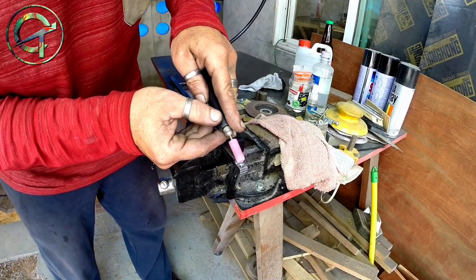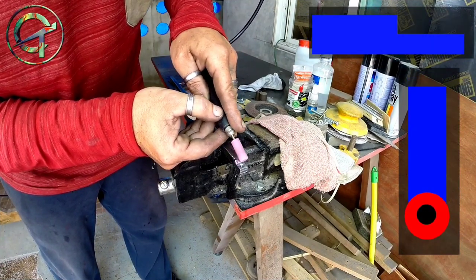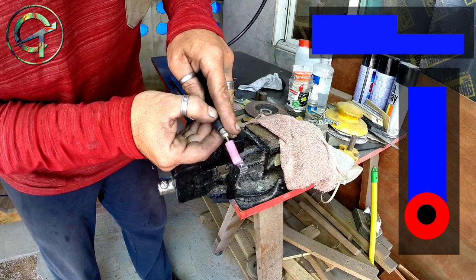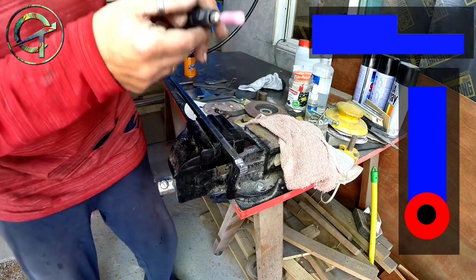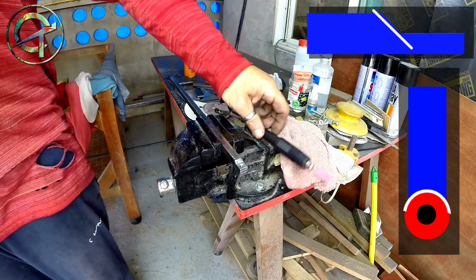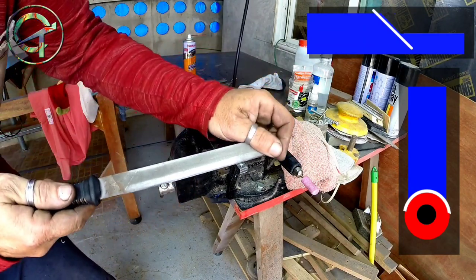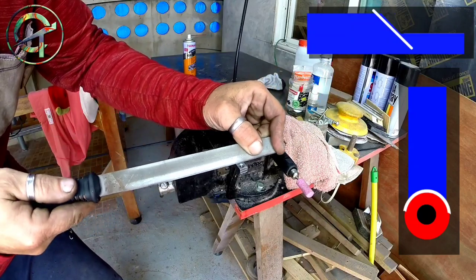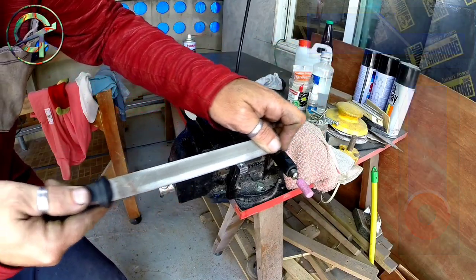Let's proceed now with the round carbide tip tool. All the steps involved are exactly the same as the one shown for the fabrication of the square carbide tool. The only exception is the round profile shown in my sketch. I hope that is making sense. With a Dremel and a round stone, I give the round shape that I refine with a fine-toothed file.